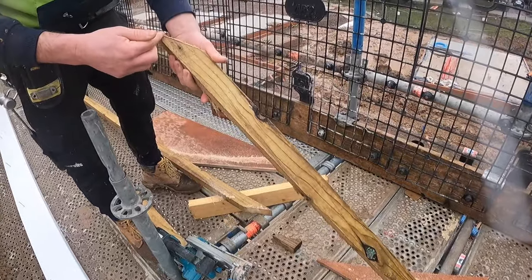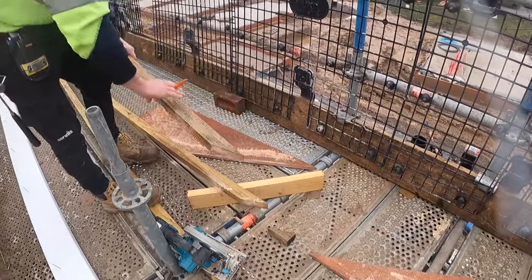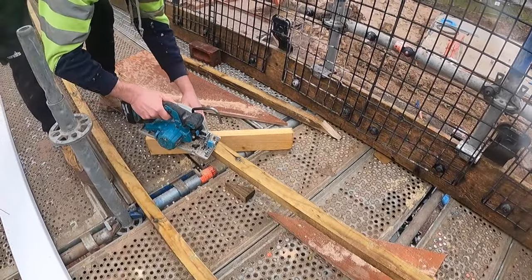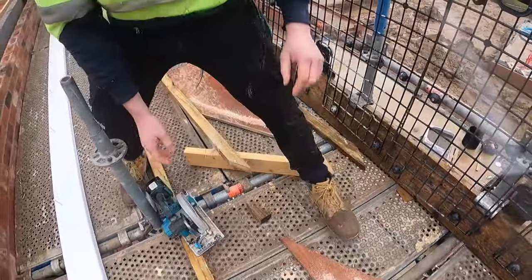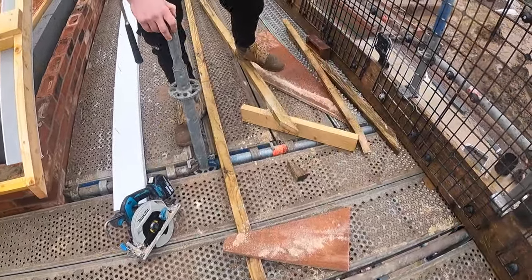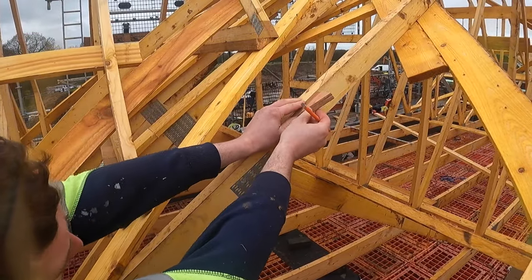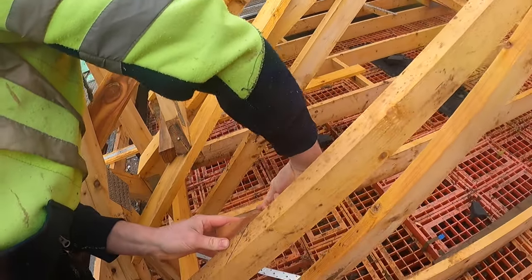I'll always just be brushing up against pencil lines, like that. Then you know you'll be the same as the ply. You can then cut yourself a little bit of the ply just to mark your depth. And you know where the top is going to be because we've got that mark for the ply there. Let's give that a depth mark, same here, all four places.